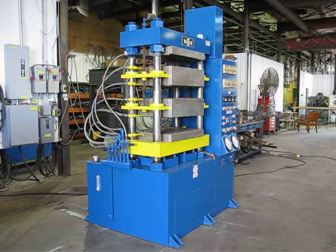I'm going to go ahead and demonstrate the press currently set up for a cycle with 2 seconds in low pressure, and then it'll switch over to high pressure for 3 seconds, then it'll decompress and open and shut off. I'm just going to show that complete cycle.